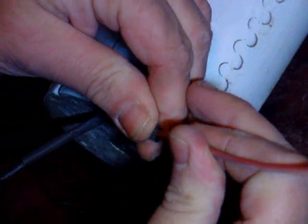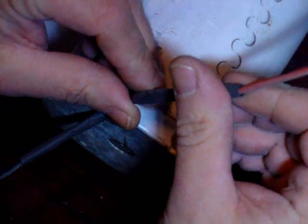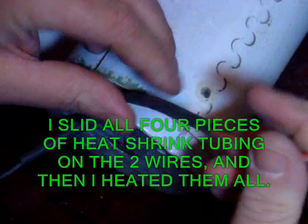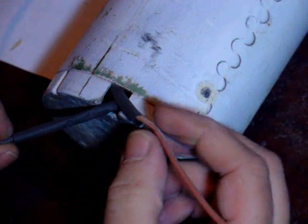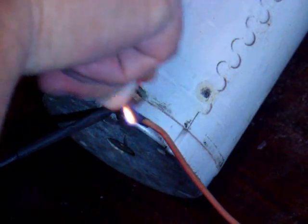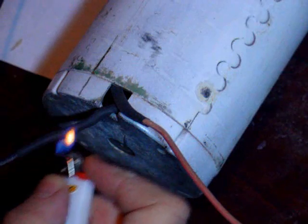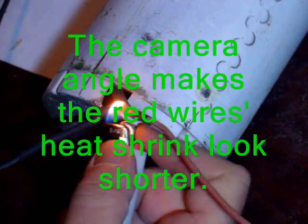I closed the garage door. I've got a couple pieces of heat shrink — this one goes all the way down to the brushes inside and it's almost the size of the wire. I know heat transfers, so rather than heating this end and making it swell out more — usually the ends get a little bit wider than the middle — I went ahead and stuck that on. Then I cut two other pieces that are about that much longer. I don't have a heat gun here like I did when I was doing the solar — same principle: keep the heat moving, do not overheat it. Get it down to size — I should be able to see the other piece of heat shrink inside.